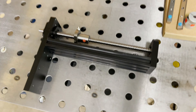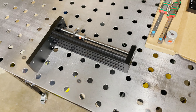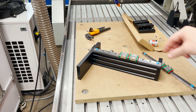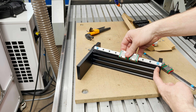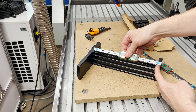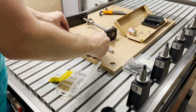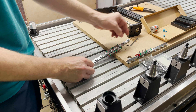It's cut to size and that looks pretty good. I need to tap the extrusion holes to be M5 and then we can get all this assembled. I forgot one final thing — now that I cut down this extrusion, my rails are just slightly too long. Let me mark those out and I'll take them over to the angle grinder and cut those off real quick. Let's start putting this all together. I'm going to put some T-nuts on these rails so we can slide them in. I got all my T-nuts started on both of these.